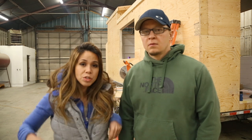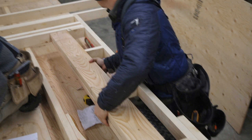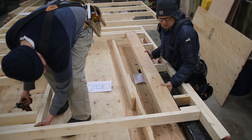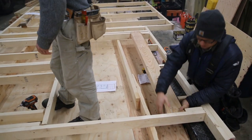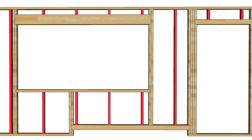On these side walls there are a lot of windows and doors, so it's really important to do a good job on those openings because you have movement right in there. We start by making a header — the header is always two-by boards with half-inch plywood sandwiched in the middle to get your three-and-a-half-inch width to match your two-by-four wall framing. Whether you use a two-by-four, two-by-six, two-by-eight, two-by-ten, or two-by-twelve depends on your span and snow loads — check span tables in your local area. You also want to make sure you have jack studs placed underneath the header so it's sitting on something solid. Keep your pattern above doors and windows and below windows to maintain your plywood layout.